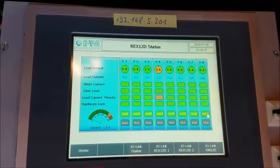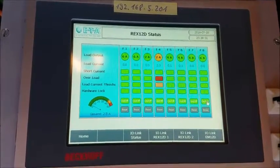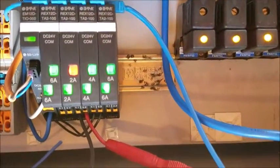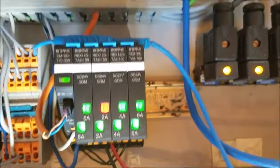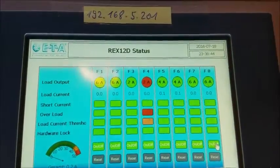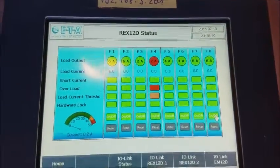If I increase the current to an overload — 1.6 — and then off. The indication shows on the breaker in red. Breaker F4 tripped due to overload condition.